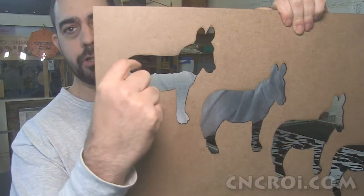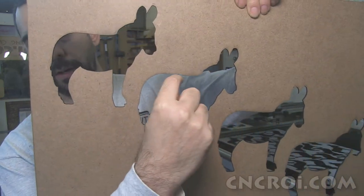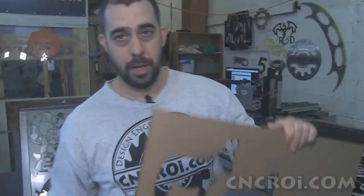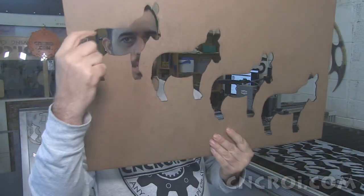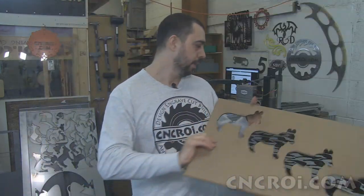I'm going to do the fiber etching here, and then it goes down a notch, fiber etching here, down a notch, fiber etching here, down a notch, fiber etching here. And believe it or not, that is tremendously faster than having them all lined up and having the laser go like this and wasting a lot of movement over area that doesn't have any fiber etching needs.